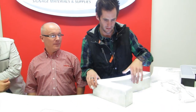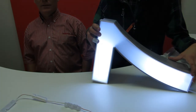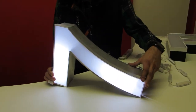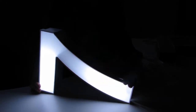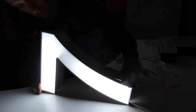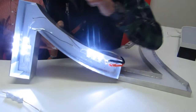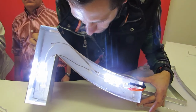Welcome back. Now what Travis is going to do for us — he's going to illuminate the fabricated LED letter number 7 here with an incorrect number of modules. Let's see what happens. As you can see, there's a dark spot over here. Let's turn off the lights so we can see in more detail. You can see this channel right over here is not illuminated. That is the dark spot. Let's take off the cover — as you can see, we've only got two modules wired, that's why it's causing that dark spot in the middle. Next we'll show you the correct amount of LEDs in order to get the correct amount of light throughout your letter.